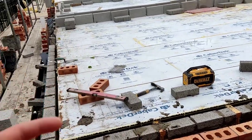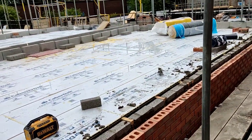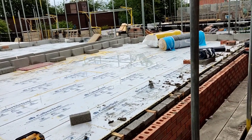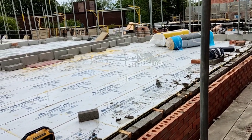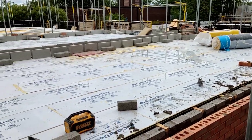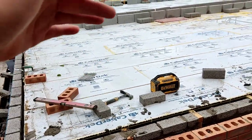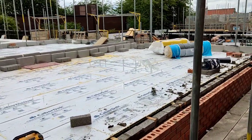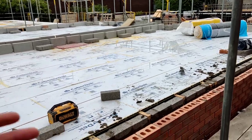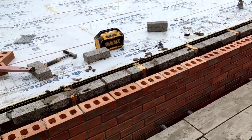it's good, but at the moment with the ready mix we're using, the mortar ain't strong enough for at least a week to be going brickwork first. You want to be on silos if you're doing brickwork first. With ready mix, it's probably essential you do blockwork first, and you've got to tie up stuff. No higher than four courses of block on ready mix, and then you can take your gables up full height in a day, but you've just got to make sure your bricks are dry.